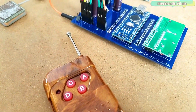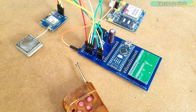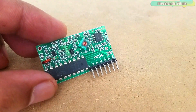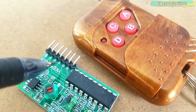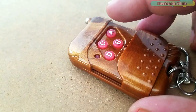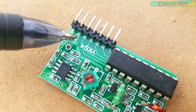The components and tools used in this project can be purchased from Amazon — purchase links are given in the description. This is the YK04 280 433MHz four-channel receiver module with a four-channel transmitter provided with buttons. Four data outputs D0 to D3 correspond to four-button remote control. The data pin will output a high level when the corresponding button is pressed. The working voltage of this module is 5 volts.